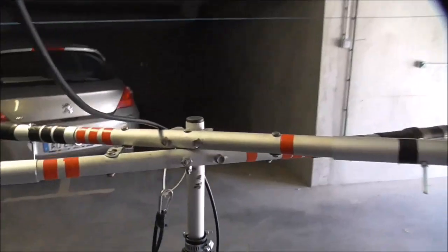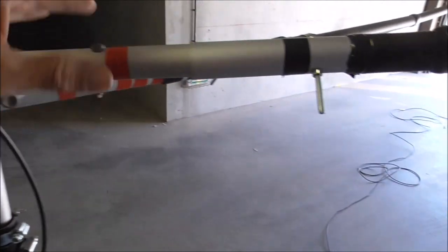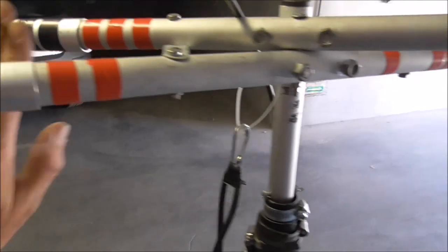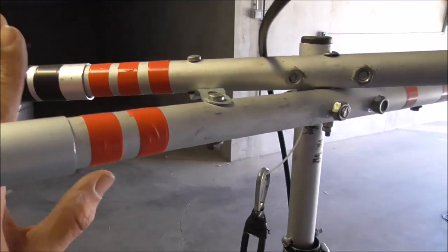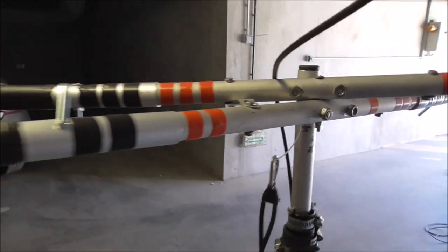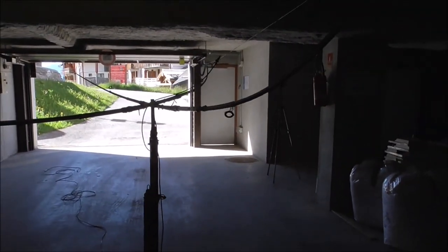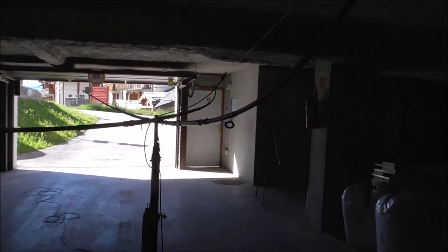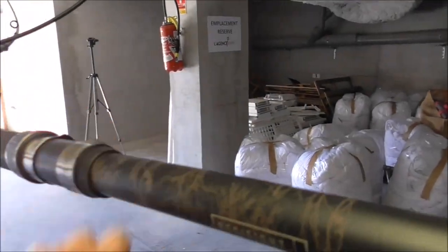The crossbeam is all bolted together with separators to keep it in place. The angle of that is 140 degrees, therefore making the smaller angle 40 degrees. That is quite important, although I've changed that a little bit. If you see that it's not actually sitting flat, it's sitting cocked up like that, so that it's pointing about 5 to 10 degrees up in the air. And that's very easily adjusted once it's assembled, just by twisting the main bars.